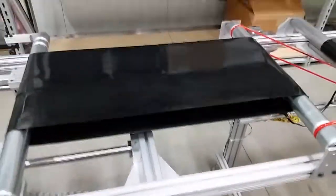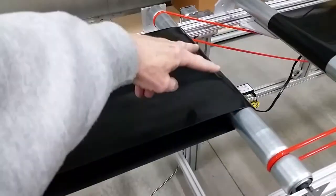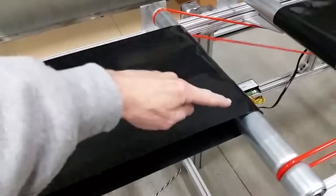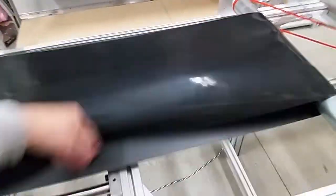Long, wide, flat belts. Two tracking sleeves on one roller, each a quarter of the way in from the edge. One tracking sleeve on the end — two inches wide, orange in this case. Belt does not walk, cannot be dislodged.